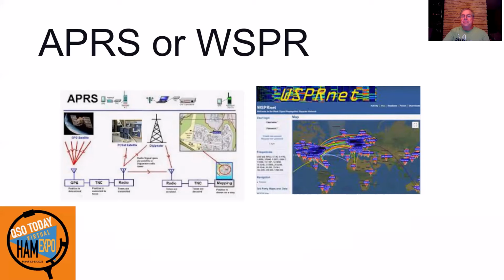Bill recommends the APRS version for beginners because the antenna is shorter, which makes the launch less challenging. That's the one I got. Bill pre-programmed my Skytracker with N4KGL-11 as the APRS SSID. The Skytracker beacons on the APRS frequency of 144.390 over the US. It also adjusts the frequency for other parts of the world, and it will stop beaconing if it's over a country that does not allow it, like the UK or North Korea.